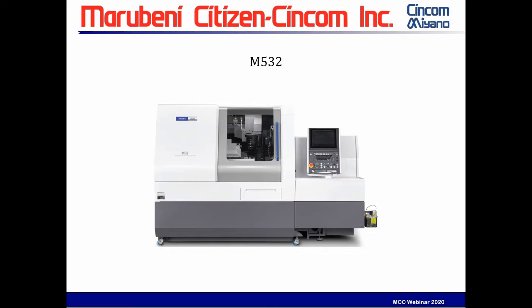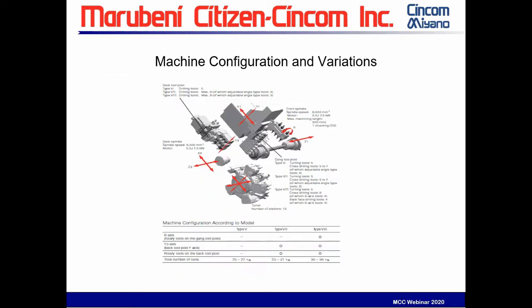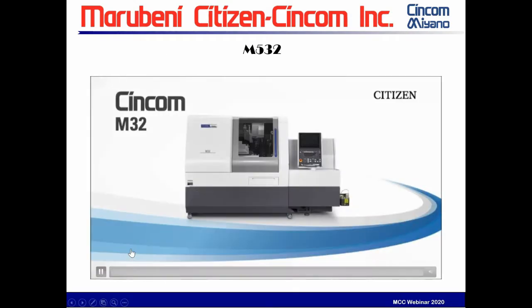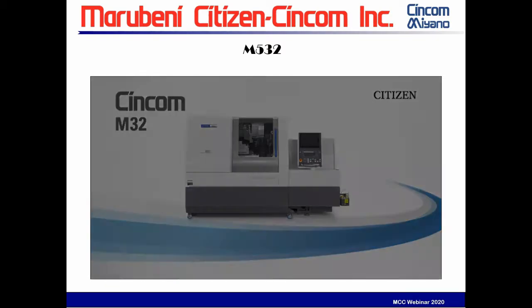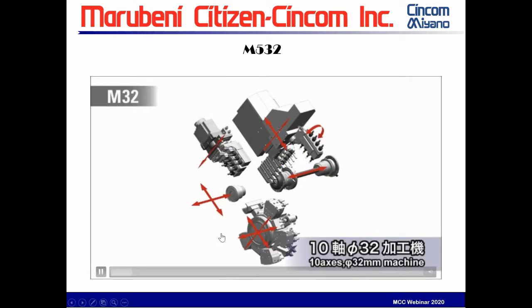To start with, as most of you may know, the M is the Citizen Cincom's top line machine. Its tooling layout, a combination of turret and gang swivel slide, allows for great productivity and versatility. And let's just take a quick look now at this video, just showing you a general operation of the machine, to give you an idea of how it functions. So you can see we've got a turret, we've got a gang slide, and we've got a back block up here.